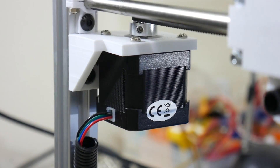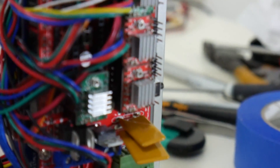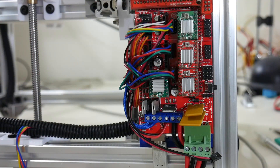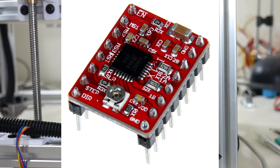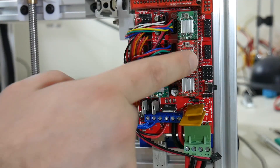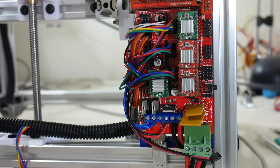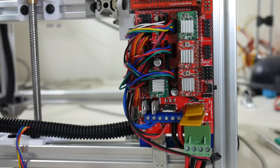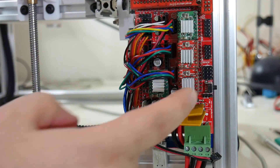It makes sense to look at how we're driving these stepper motors. Panning across to the RAMPS board, we can look at the step sticks used to drive them. The most common stepper driver chips for 3D printers are the A4988 step sticks, usually set in 16 microstep mode. So for every full step the stepper motor provides, these drivers chop it down to 1/16th, providing greater accuracy and smoother motion. However, there are other options on the market.